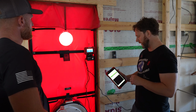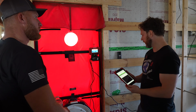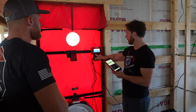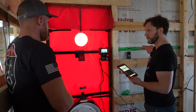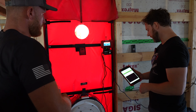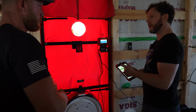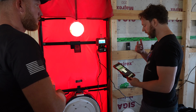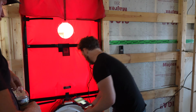Okay. So it gets you better data in windy conditions. And how does it know that with that being closed up right now? Where's it measuring? Off these two sensors here. So in this case, it's looking at the pressure between the house and the outside. Okay. So it's looking at channel A, which we've got in the garage. So we just redid the baseline now with the wind assistant on. And I went in and made a change too because this is a really tight building. So the fan's going to operate a little bit slower so it doesn't overshoot. Okay. And we'll start on ring C.